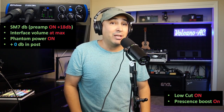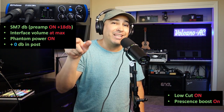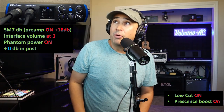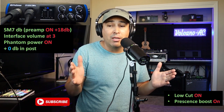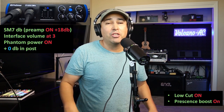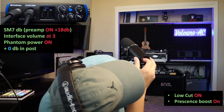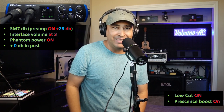Now I need to talk a little bit softer because it's way louder. Let me reduce my volume on input number one — I cranked it up before, so I want to go backwards now. We're now at three o'clock. Hopefully that's not too quiet for this demo, but the reason I went to three o'clock is because now it's time to crank up our preamp again. And now we have plus 28 dB.